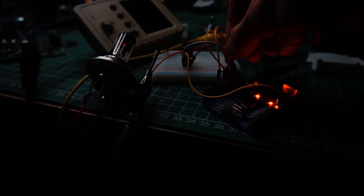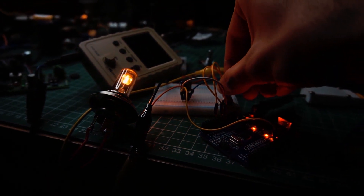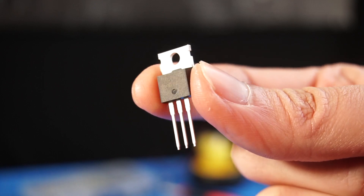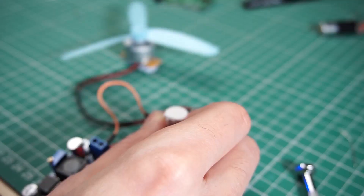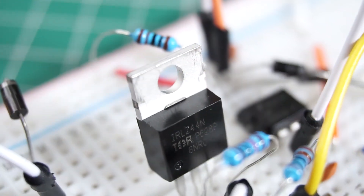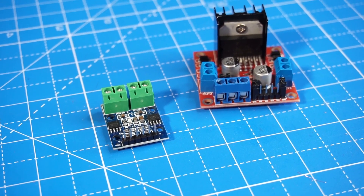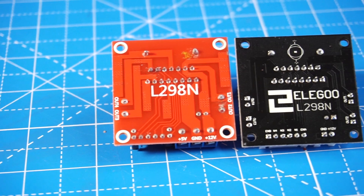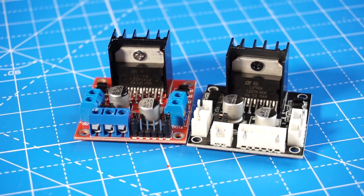The simplest way to control a DC motor or any other load like this light bulb is with the use of a single MOSFET transistor. The problem with a single MOSFET is that the speed can only be controlled in one direction and not in reverse. To achieve control in both directions we will need an H-bridge. There is a big variety of integrated circuits with an H-bridge — the most popular one is the L298N, which can be found in modules like this.